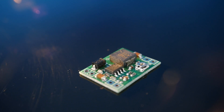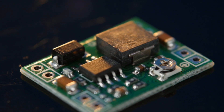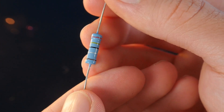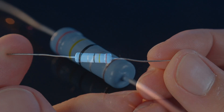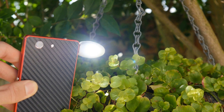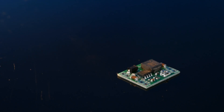The next thing we'll need is a micro-voltage regulator. This is essential as it steps down the 5V output of the phone so that the LED we'll be using doesn't draw too much power. Usually resistors are used for this role, but as they throw away the extra energy in the form of heat, the LED would run much dimmer and the resistor itself would get extremely hot, which is why a voltage step-down circuit is a much more sensible idea for use with high power LEDs like the one we're using in this project. As these boards are a little hard to find, I have placed links to them in the description.